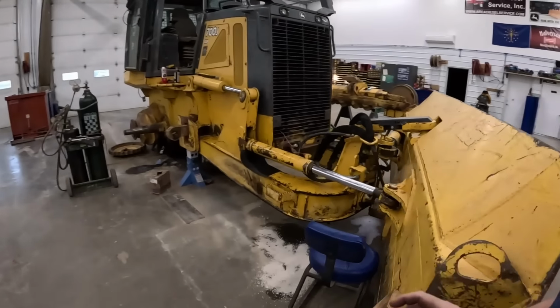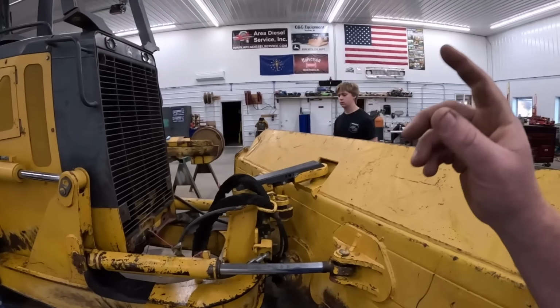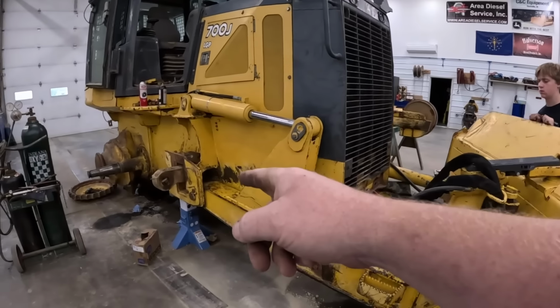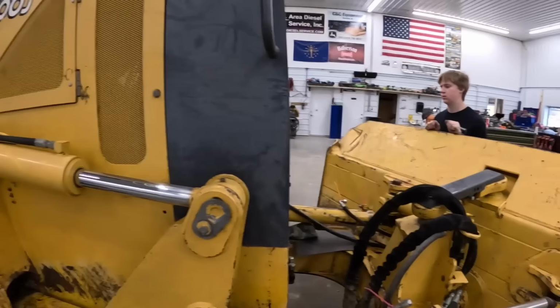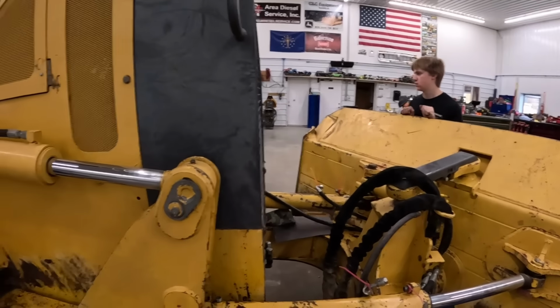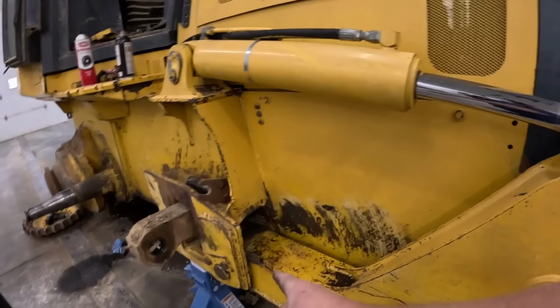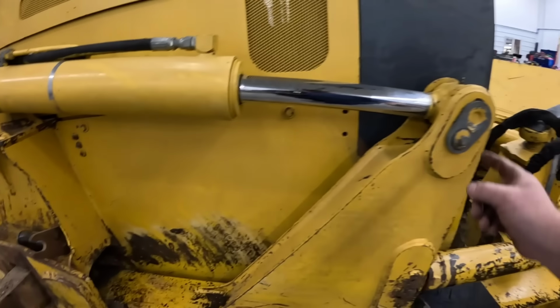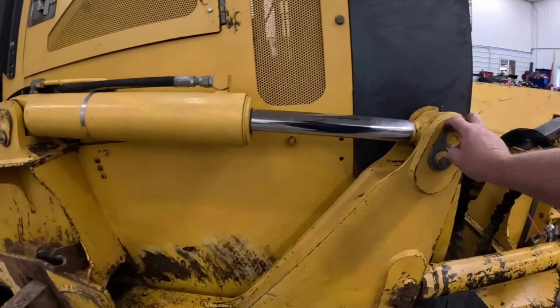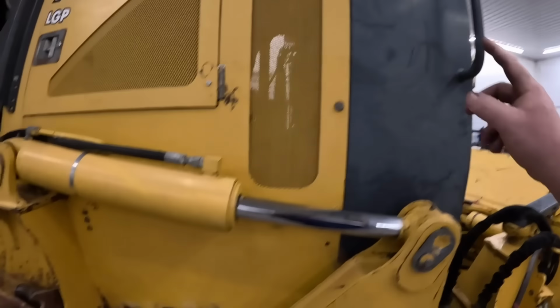We've been doing some other projects, so underneath, Tucker, you've already took that belly pan off. You got 2 grease hoses that go in these pins here. You go down there and take those out. I think it might be a 9/16 wrench. I'll get you whatever you need to get a light. So we're gonna take this whole C-frame off here. We can take these lift cylinders off here first, Tucker. You wanna do that and we'll tie them up.